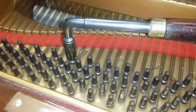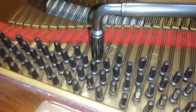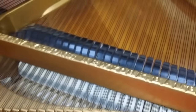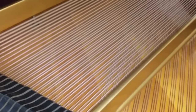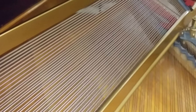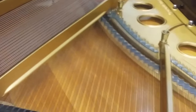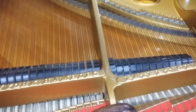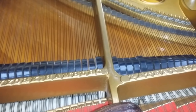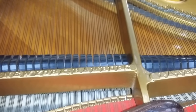As soon as you hear it was restored by Steinway, you think it's going to be done well - and indeed it has been, though I have no paperwork to prove it. It does have some trademarks of Steinway restoration. Tightness of the tuning pins is really important, and the soundboard has obviously been restored. Generally speaking, if no strings are broken, if none have broken in the past, and the tuning pins are tight, the down bearing is good, and there's nothing else wrong, there's no point in restringing.